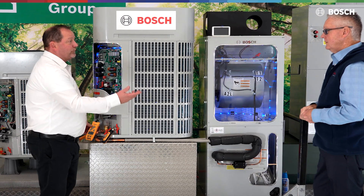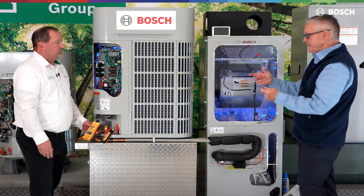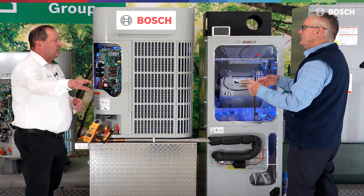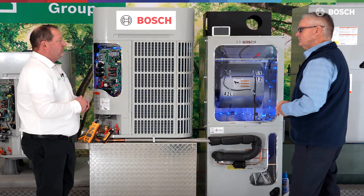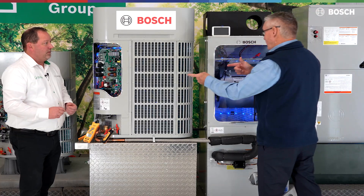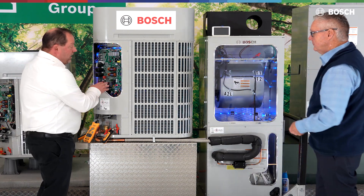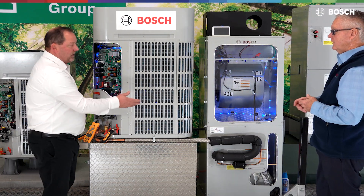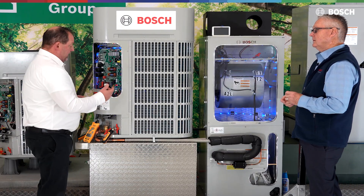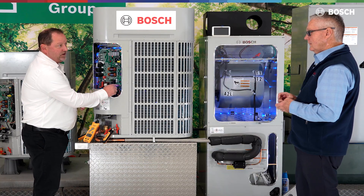Right now I'm reading just the outdoor fan motor — about 1.5 amps. That'll shut off in about 45 seconds — that's the logic of the fan motor. Then this is going to take roughly about six to seven minutes, based on field testing we did earlier. During that six or seven minutes we've got the fan on high, dispersing what would be refrigerant particulates into the duct system. Then we're going to reset. The outdoor unit didn't show an error code because we're talking about a sensor detecting a leak — the sensor shut off based on a refrigerant leak — so it just went back to ambient temperature.